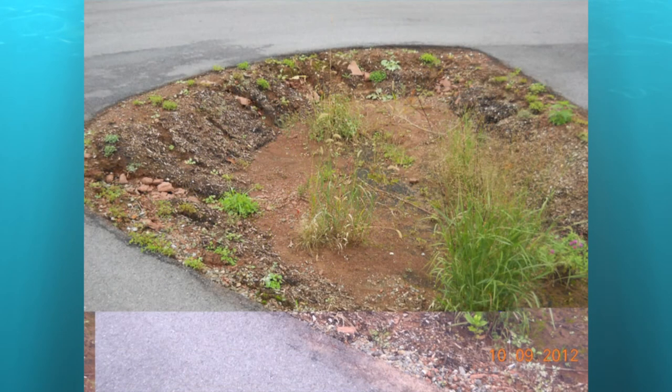This is another rain garden designed at a local complex. The designer called for mulch on two-to-one slopes — but grass mix doesn't work in mulch. They never stabilized the banks, so sheet flow eroded the soil basically down to bedrock. All that soil coming out of the side banks is now filling in the bottom of the rain garden and will eventually clog it and stop it from working altogether.